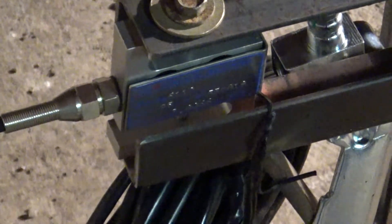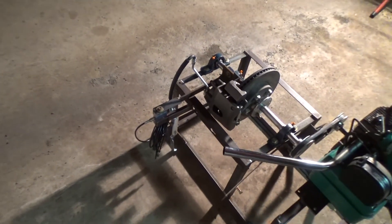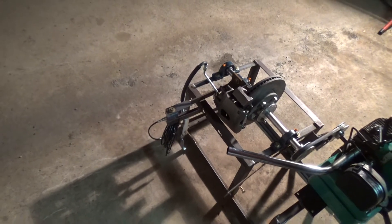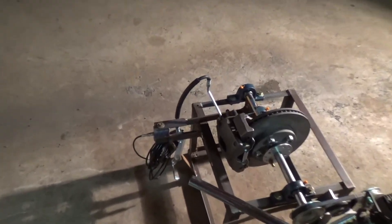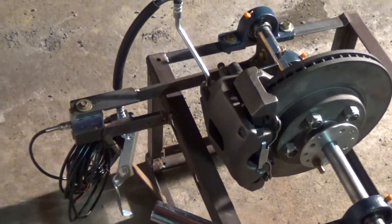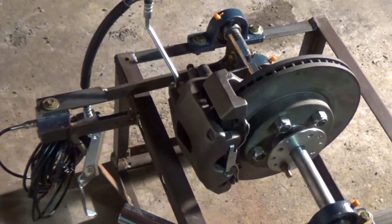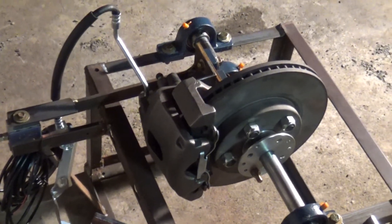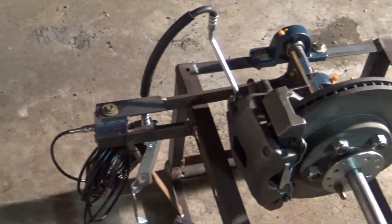It's hooked with a rod right there to my load cell. It's a 25 pound load cell — rated 25 pounds, but I actually checked it and it's good for 34 under compression. I've got it kind of fooled a little bit. That caliper has some weight to it, even just sitting right there — I'm guessing about 10 to 15 pounds on that scale, because it's bearing on the shaft. There's no actual rigid fixed point until it's on the load cell.